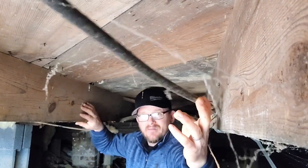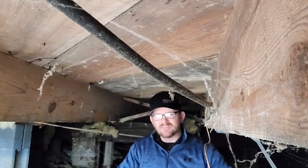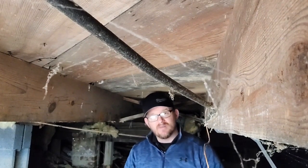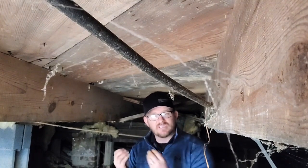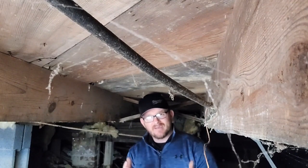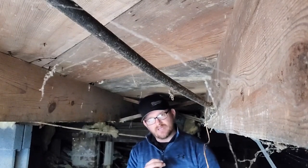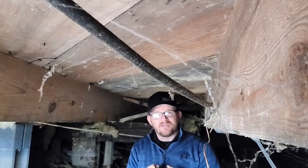If you notice right here in the shot, this is an electrical wire right here. There are mechanical pipes, plumbing pipes, all different types of things in this crawlspace that under normal circumstances are not a danger. But if you're down here with them, they absolutely can be a danger, especially if that piece of equipment is faulting in some type of way. There are many people, unfortunately, who have died in crawlspaces from electrocution — backing into old light bulbs, backing into a light fixture, getting in between a shorting circuit or a shorting piece of equipment and ground. And like I said, you are the definition of grounded under here.